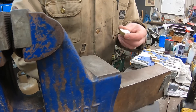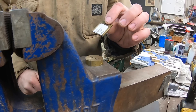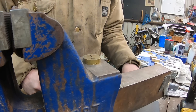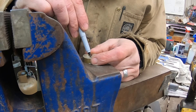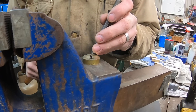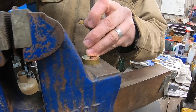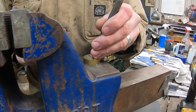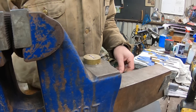The way I'd describe my methodology on guards — especially if they're something other than just a flat guard — they're going to have some contours or three-dimensional qualities. I'd describe it more as a sculpting exercise than a machining exercise. There are ways to get much more precise and even quicker — for instance, if you have a milling machine, milling the slot out is relatively simple, easy, and quite efficient.